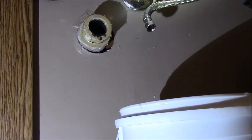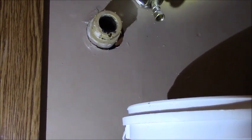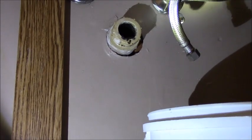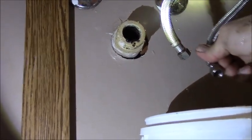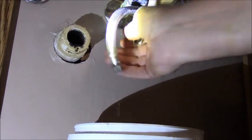Drain that out of the faucet before I drag it around the house. I'm going to pull this to the spare bedroom because, as I said, my brother-in-law is remodeling a house and needs one. So open the faucet and it breaks the suction so the water will run back down out of the pipes. By the way, there's a hint.